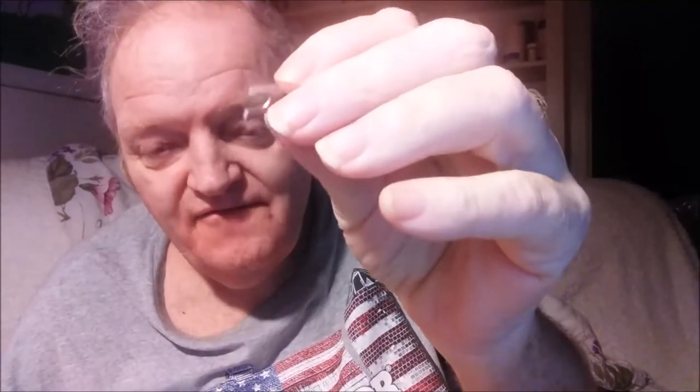I have multiple sizes — I thought I was picking up two different sizes but I picked up two the same. These fit AWG 12 and 10. I've also got them in 14-12. Those are the only two sizes of wire we're using for the small wire in the house. Everything else is like 6, 8, or 4 AWG.